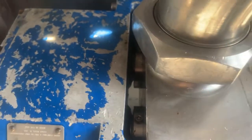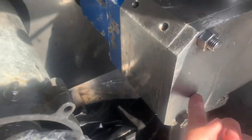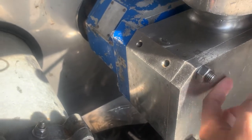All right, so then you get in here and you double check to make sure that your pump actually moves. You might be able to see the spin. So what you usually want is you want the product to flow on the outside of the pump. So that means that if we're coming up from the bottom, it needs to go out and around and up. Which means that these propellers inside this pump need to spin towards the inside. And that'll determine which way you pull your handle.